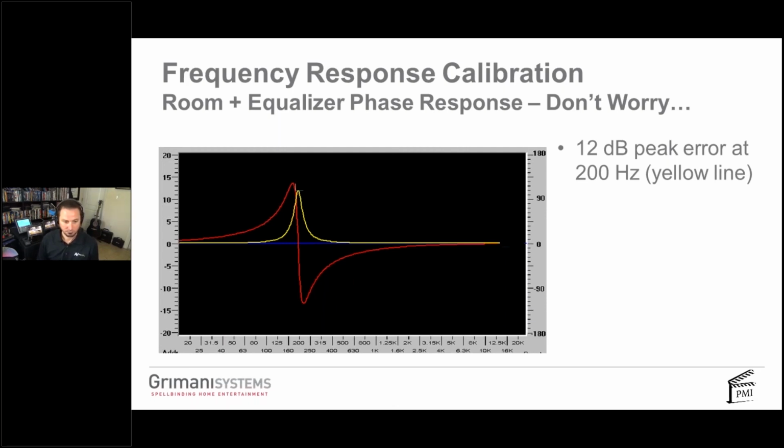If it's a reflection, the mere fact that you're thinking of the sound coming at you being followed later by a bounce off the room that's adding signal into it, that bounce is out of phase. It's rotating, it's in a different phase, it's at a different time. It's rotating the sound, the time domain around. So if you realize that the room errors will have amplitude and phase errors, because you can't really do it without that.